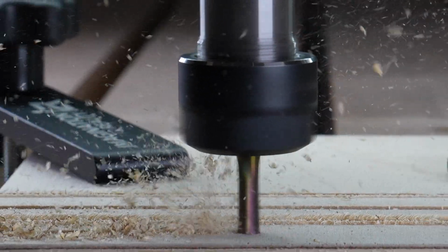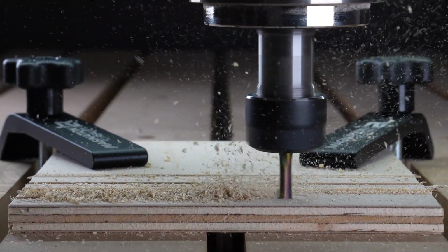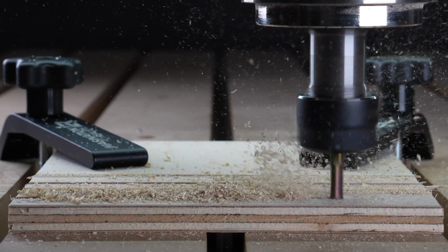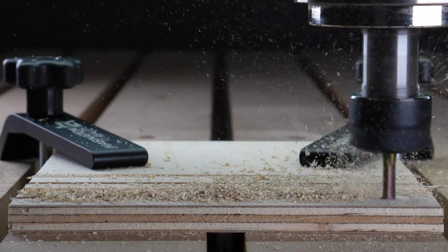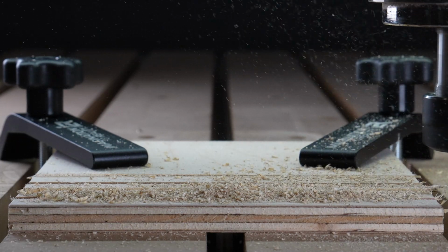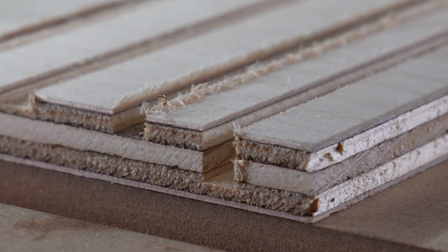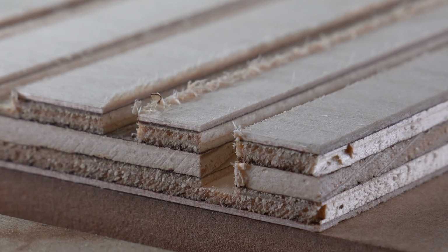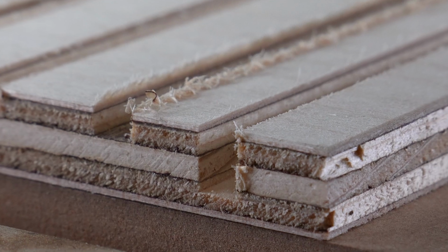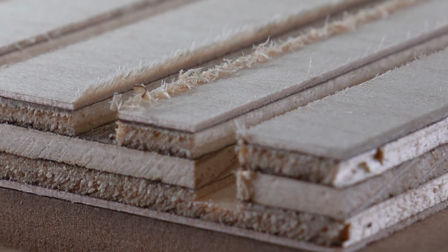Normally the change in geometry between the upwards and downwards portion of the cutting tool happens at the diameter of the tool. So for a 6mm compression cutter, we need to cut our first pass depth or our depth of cut greater than 6mm deep. So anything like 6.5, 7, 8 or 9mm would be a suitable first pass depth of cut for a 6mm compression router bit.